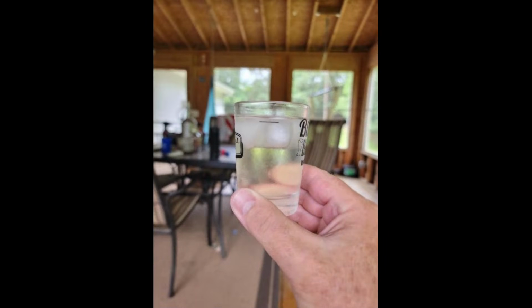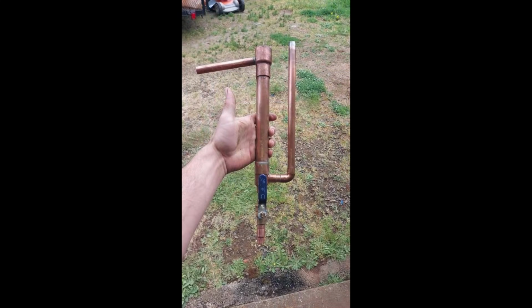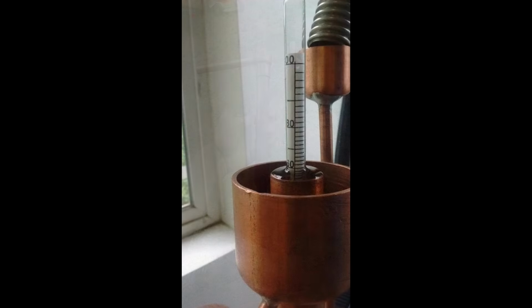If you've got a still, like a copper still that requires pasted joints, make sure and get everything pasted. And pasting is just a mixture of paste made from flour and water, and it's dabbed onto the joints to prevent vapor from escaping the vapor path during distillation. That's all that is.